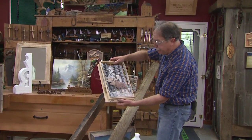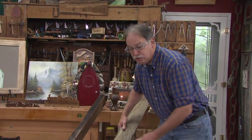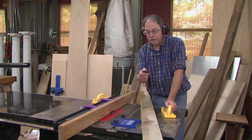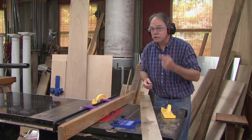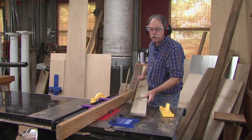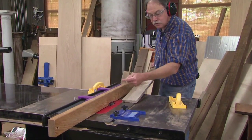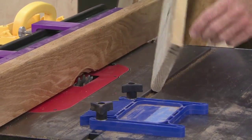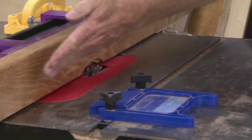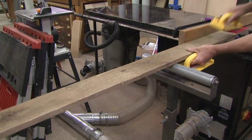Those are the tips about the wood. Now what we're going to do is some dado work to frame out the 3D carving that Susie did last week, and also cut frame material for the traditional framing. Off to the table saw. Remember, work safely — whatever you do, read, follow, and understand all the instructions that come with the tools and products you use. I'm using a stacked dado assembly on the table saw with a sacrificial fence, so I can get a cut that's three-eighths of an inch deep and a half an inch wide. I'm using a feather board on the outfeed to securely hold the work piece against the fence. I'll make these cuts using a push block for all the traditional framing material.